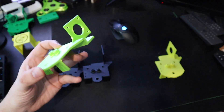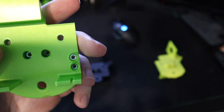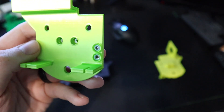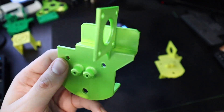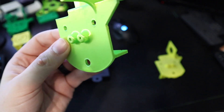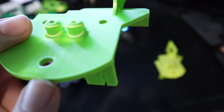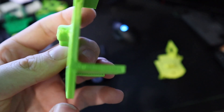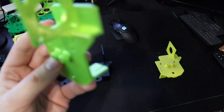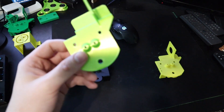Moving on to this one — we fully made it all connected here, along with sinking hardware into the holes so that there were metal threads in there, and this was a pretty solid revision. I got about 30 or so hours out of it, but as you can see, it actually warped a little bit and there's a burn spot right here from the hot end. The hot end heated up the whole bottom of the carriage and it warped a little bit, causing it to wobble some more.